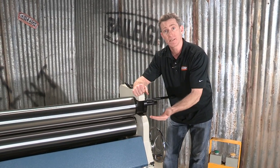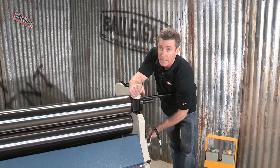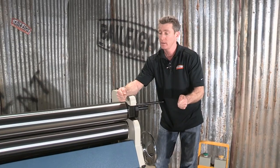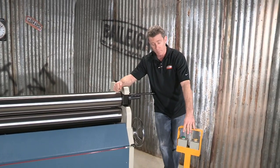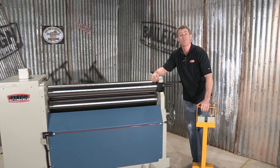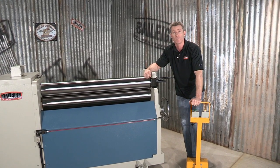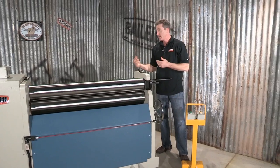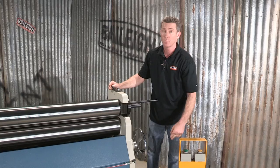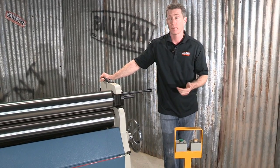We would simply bring a piece of material into this machine, turn this hand wheel, bring that pinch roll up, and pinch that material nice and tight. Then we're going to actuate it by pressing this foot pedal control. Now we've got all three rolls driving, and we're going to drive that pinched material into that forming roll in the back. We can simply bring that roll up by pressing this button, and we can pre-bend. We can also post-bend, then simply press the foot pedal.